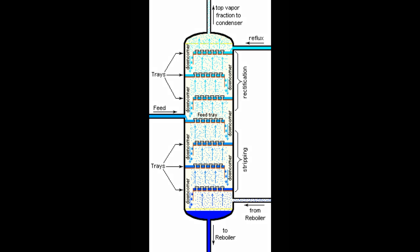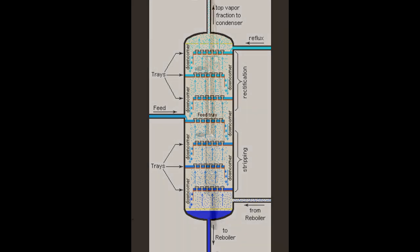My first attempt at a continuous rig was to adapt the column I used for pot distillation by adding an injection point and wash preheater part way up. A bit of experiment showed that this wasn't going to work. Packed columns like this are sensitive to vapour and liquid flow rates, and when using this with a pot still the boiler power has to be controlled within 1% in order to maintain over 96% alcohol output. This happens when the section of the column above the isothermal deflegmator has the right balance of up-going vapour to down-going liquid. If you now inject hot liquid directly into the column part way up, there will be much more liquid flowing down the lower part of the column, which will be far from its optimal operating point.